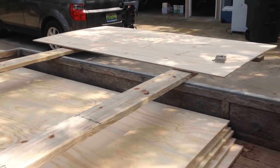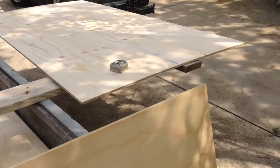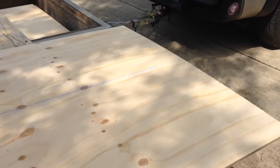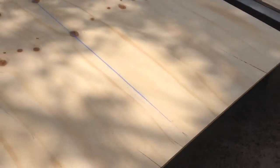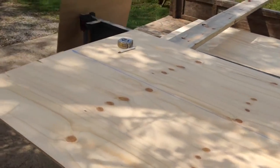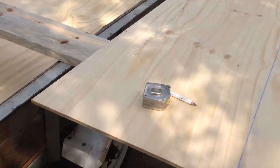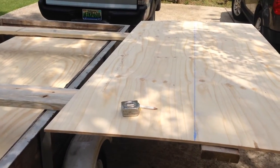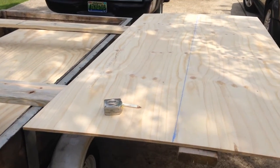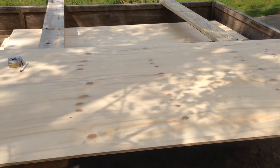That's going to sound like crap on video, but I'll take my frame in pieces, clamp them down to my trailer, stick them over the side — sawhorses, sort of — then I got a piece of two-by-six under there. Marked out the dimensions of the first panel, chalked it. You guys know I can't tell you any dimensions because that would not be fair to the designer. But there it is, that's the line struck. First piece, we're going to run through it with the old worm drive saw and we'll be on our way.